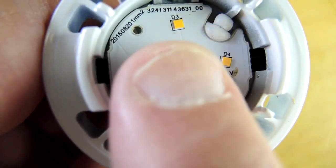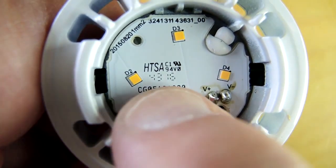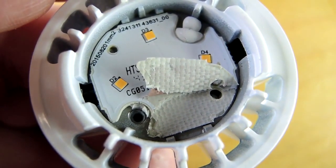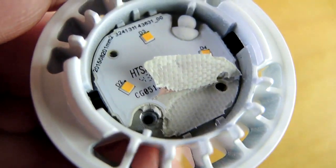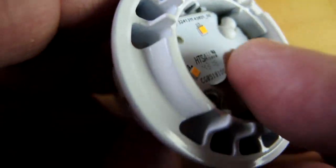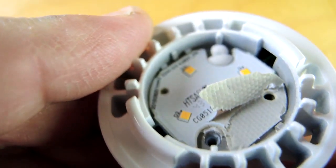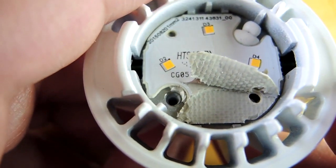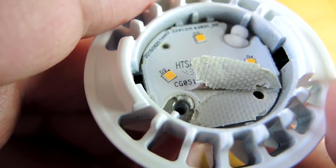Obviously the four LEDs. It looks like the emitter has also been glued to help retain it, but that wasn't quite enough, and of course we can see the voltage coming in. This is an interesting cost-saving move — these emitters have historically been made with aluminum back substrates because they conduct heat very well. You can see Philips going for a more cost-effective approach here: a very heavy metal-plated layer, but when I was prying it up you can clearly see the weave of fiberglass below that. The fiberglass material is of course cheaper than aluminum, so that's why they're doing that. This is quite different from the structure I've seen in their previous bulb four years ago.